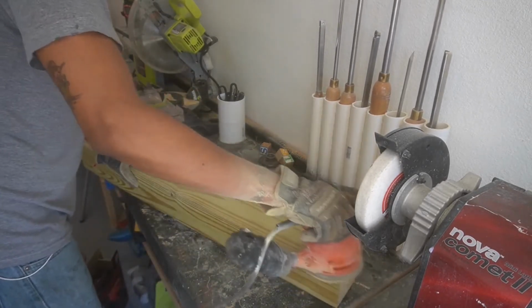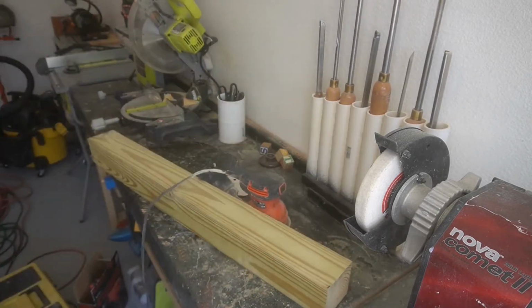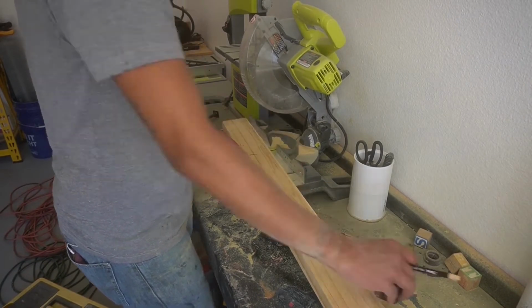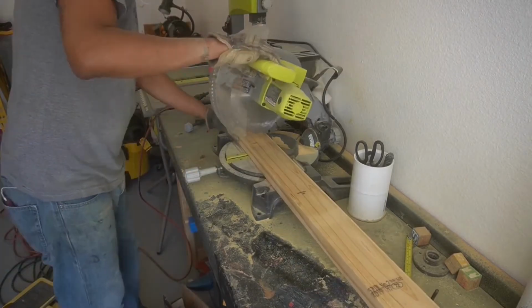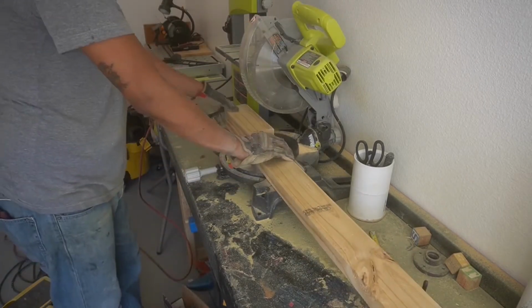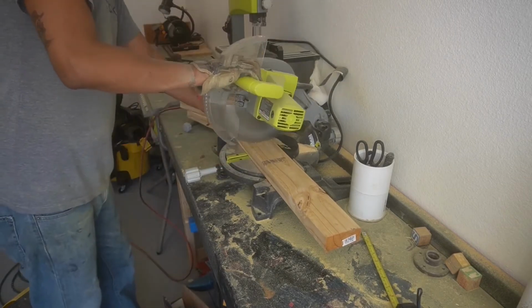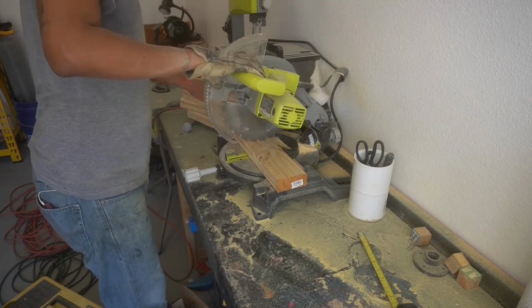So here we are. We're basically just taking that superficial layer off. Actually had to leave this one in the garage. It was hot as hell in September of 2022. Obviously we had that heat wave here in Texas, so it had to dry out the wood. The wood was a little damp. It always works a little bit better once you actually dry the wood out. And I didn't show you the whole sanding part, but essentially 60 grit and just going through and sanding everything down real nice and neat.